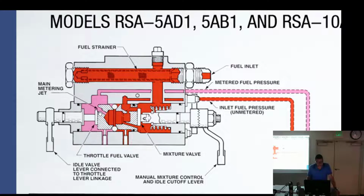We can also look, I don't think this shows a representation of that parallel economizer jet, the enrichment system jet. Okay, so follow me so far? So we're now off and running, we're in cruise. This can be wide open for mixture, or I can pull the mixture back a little bit, start reducing the fuel flow through here before it gets to the main metering jet. That's going to lean it out a little bit. Pull it all the way, it's going to shut off these passages, cut off the fuel, and the engine dies. That's how we shut it down.